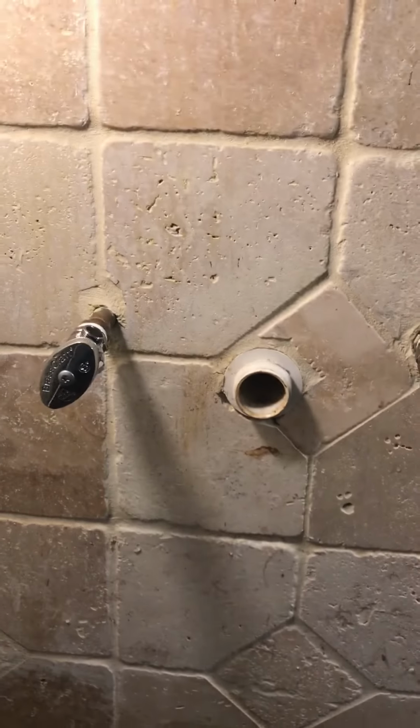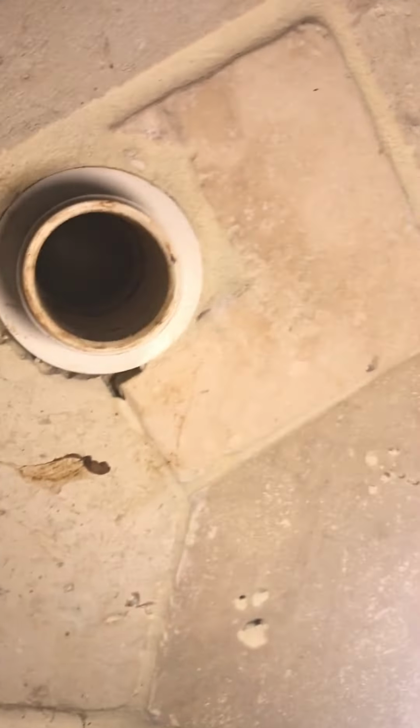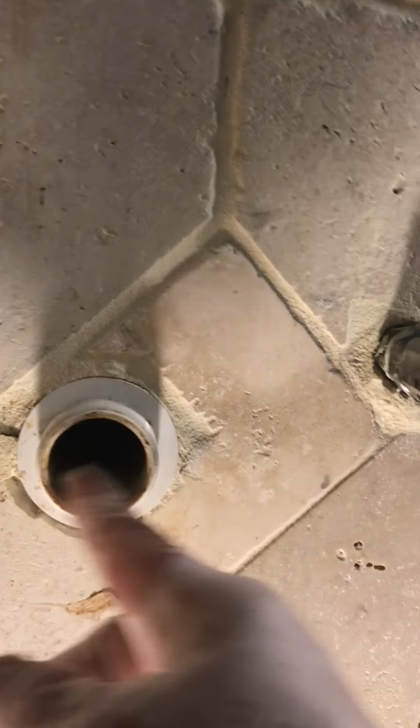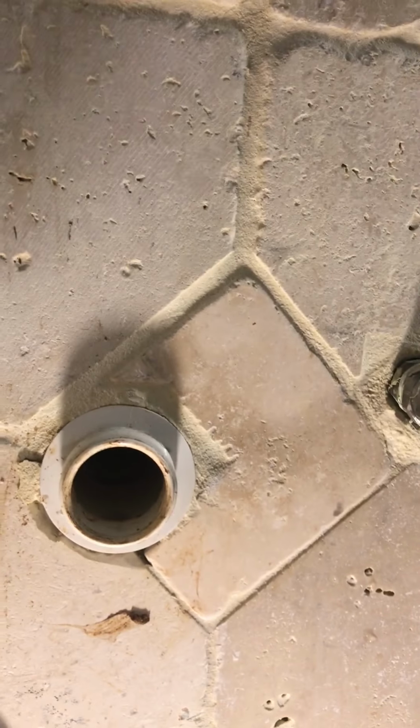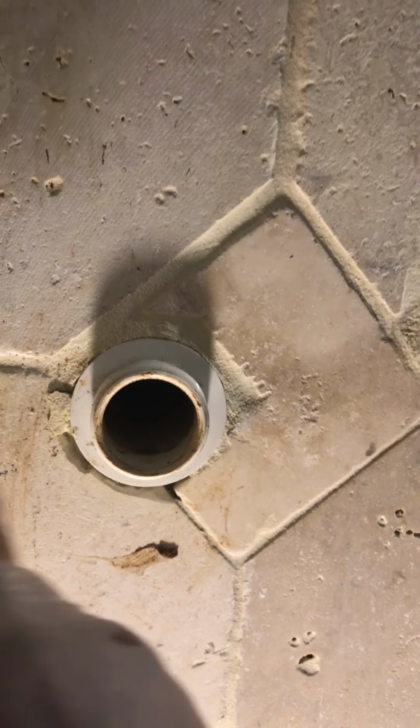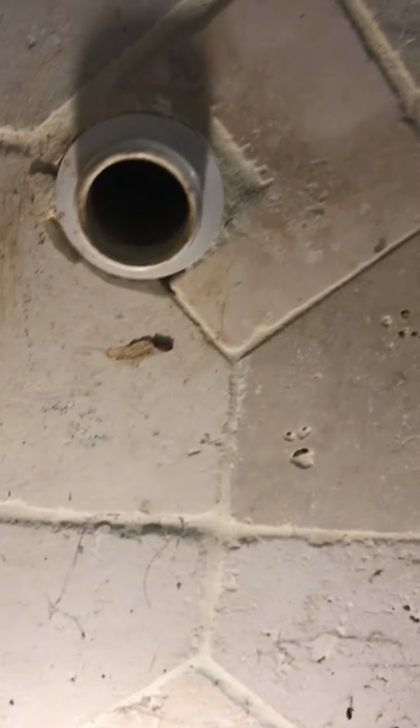And also, I noticed that there is only one pipe. I don't think you can see it, but this pipe is connected to the laundry machine and to the sink. So I think that's why it's causing this problem, because there's too much water that the laundry machine dumps, and then it might be something stuck inside the main pipe. That's why the water comes back to my sink. But that's why I'm gonna cut it.